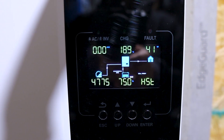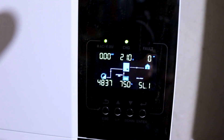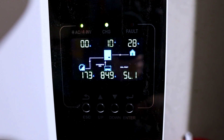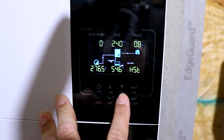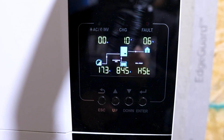One inverter is reading about 4700 to 4800 watts, very similar numbers on both. The amps are coming in at 17.2, 17.3, and around 17.4 to 17.5 amps on both strings — sorry about the noise with the inverters kicked on. About 17 amps coming in on both. Let's go ahead and put a little shade out there and see what change we get.